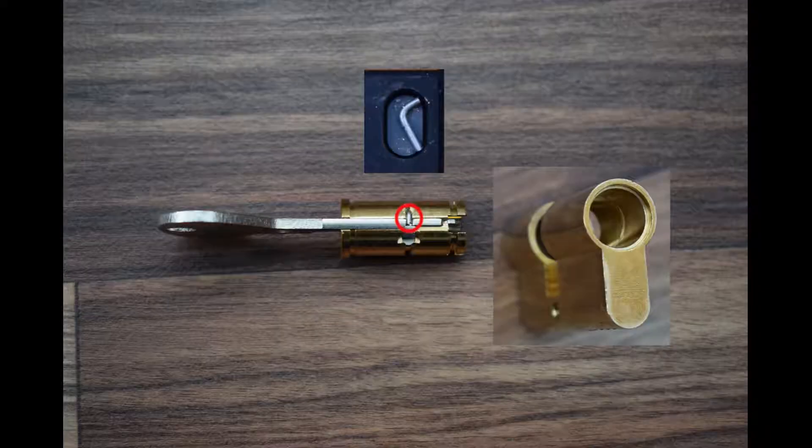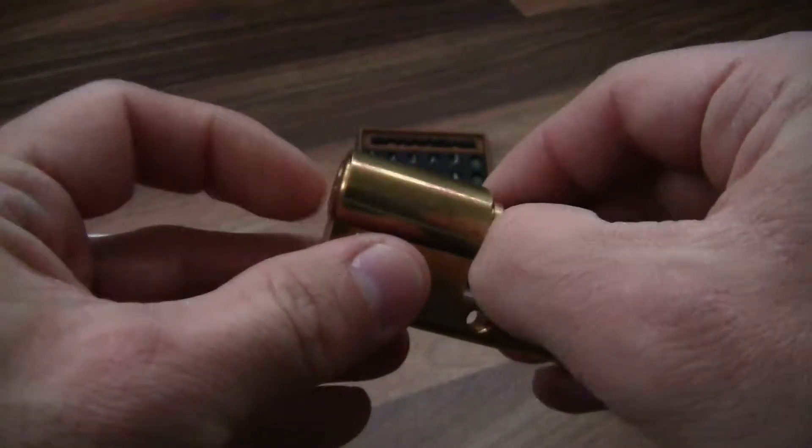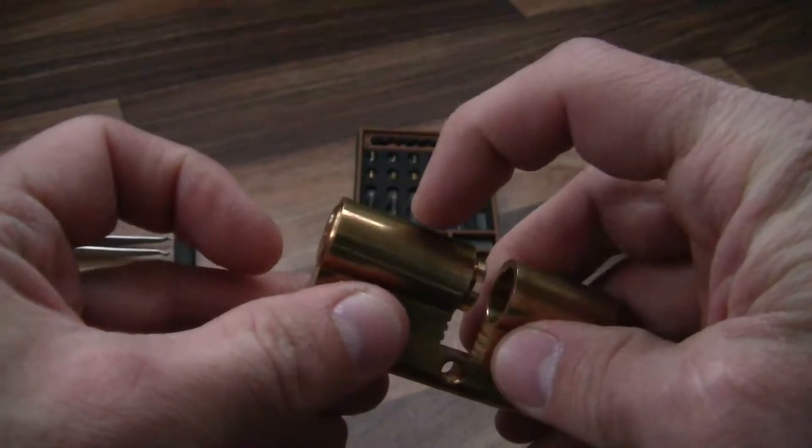Gutting of the RSG version is a bit harder compared to the rest of the 200 family. The movable steel insert gets stuck a bit above the core, preventing the core's removal. To free it, a small tap is needed to force it back into the core, and after that the core can be removed. Now you can see the core is blocked again because the wire insert is sticking out of the core.